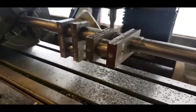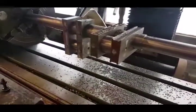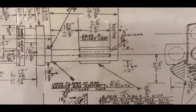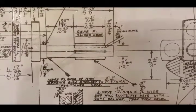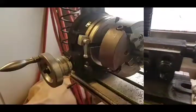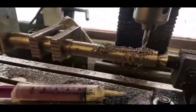The tops are all I'll do on the lathe because they obviously need to be turned. The next job is to mill the keyway slots — these are 3/16ths deep by 15/64ths wide. Instead of using 15/64ths key steel I'm going to use 6mm key steel. I've left it set up in the rotary table. Because this is a 90-turn to 1 revolution rotary table, I'm going to use 22 and a half turns of the handle to get one quarter of a turn.